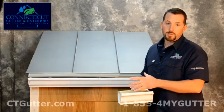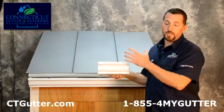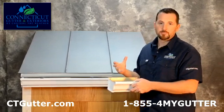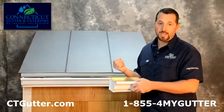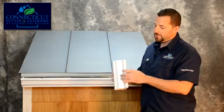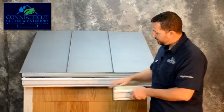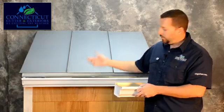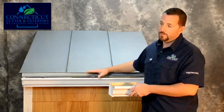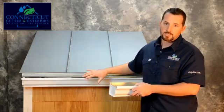However, we're talking about doing this on a rain gutter. Rain gutter is out in the elements, it's up on the house. Trees are dropping and releasing slime and debris and pollen and dust and dirt. So the surface of that hood gets dirty quick. It does gain a film. Even if you can't see it by the eye, it still looks relatively new and shiny. When you get up on it, there's a film on there. And once that film is achieved, molecular adhesion, the concept of molecular adhesion, is hindered.